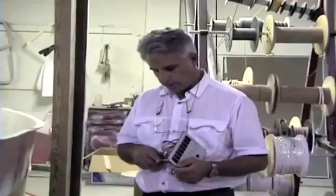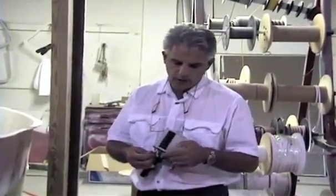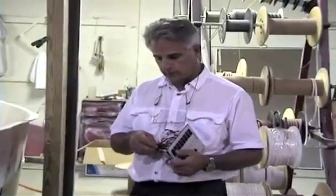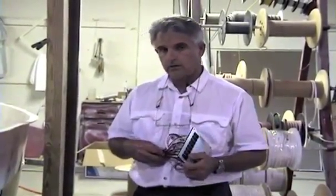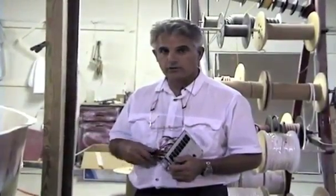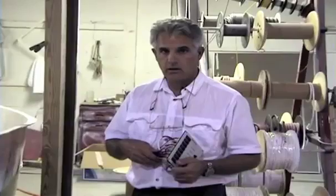Every one of these wires — whether they be accessories, cabin lights, or steaming lights — the wire runs from the panel to the resistance, to the light bulb, or wherever it's going, with no breaks along the way.